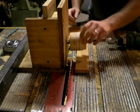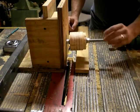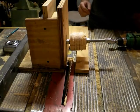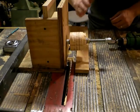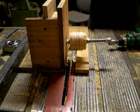This is my rig for attempting to make v-belt pulleys. Basically this gets spun past the blade, which is tilted at 15 degrees, and we just make a v-cut into each of the two grooves that I need. Let's see if this works.